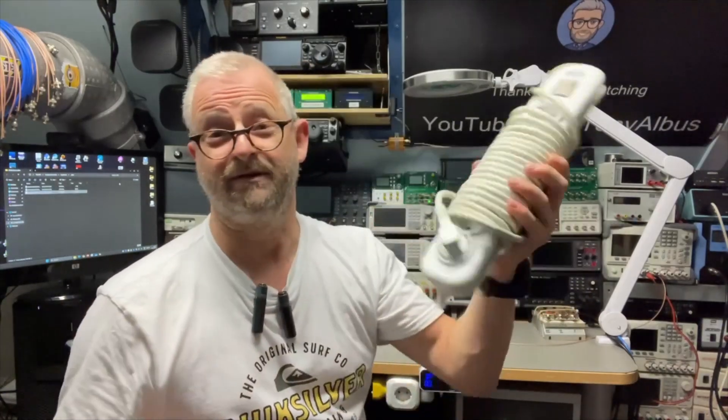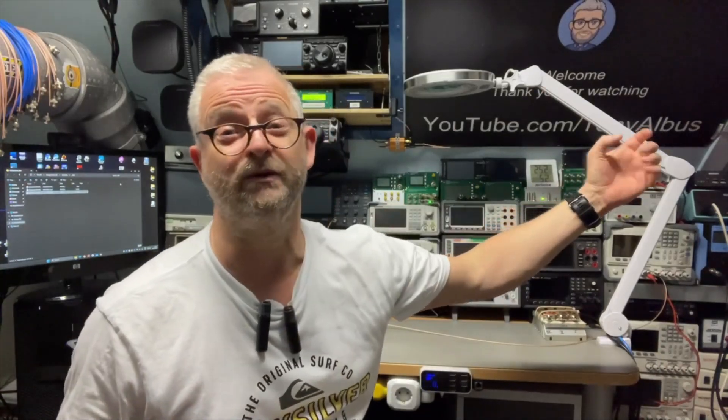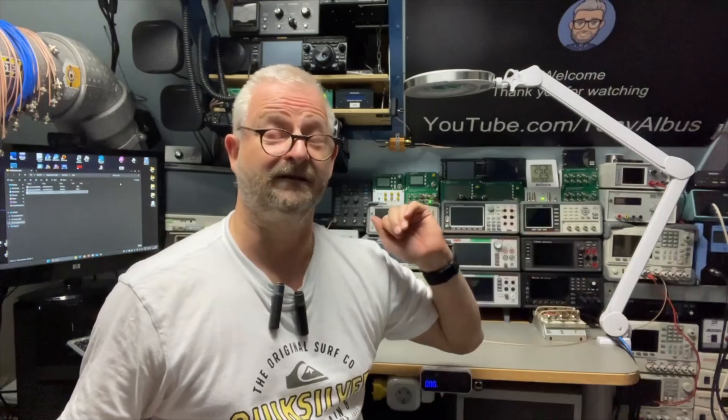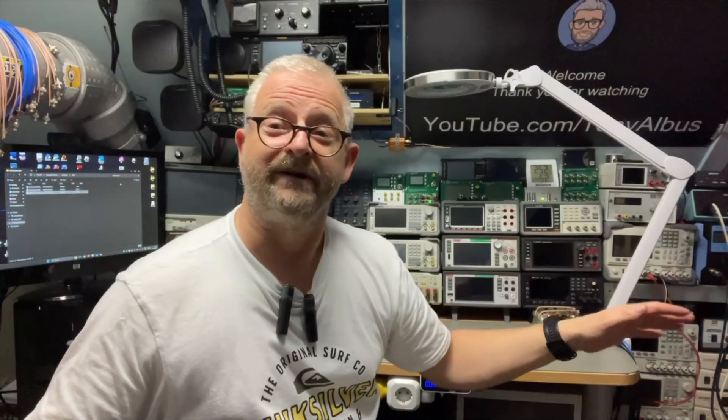A type 3 could be bigger and it has filtering — you find on the back it says it's a type 3. So in my case the type 1 is somewhere in the neighborhood in the big transformer, hopefully. Everything not caught by the type 1 will now be caught with my type 2. The type 2 also handles over-voltage. For lightning it's easy — you have two metal pins and it will just spark from one pin to the other. The over-voltage is probably done with a varistor and it will just short-circuit to ground. For a short period that's okay, but for a longer period the main fuses will trip — and those are automatic in my house. So the power is restored and you are protected.